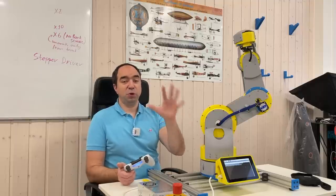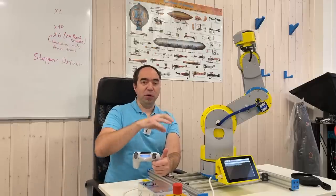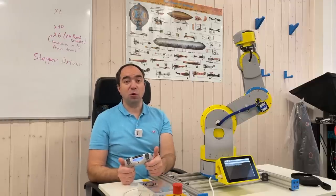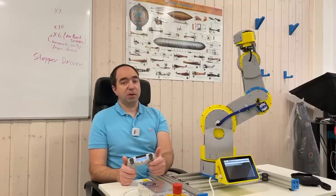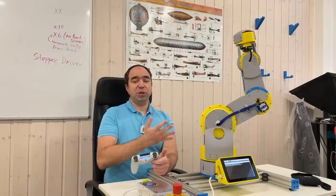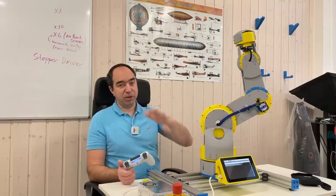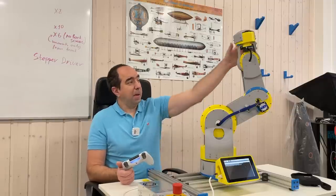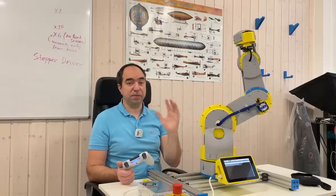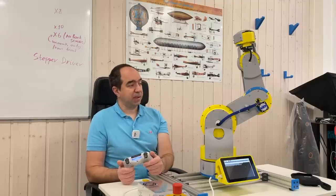There are some things which we need to improve. The program on the Raspberry Pi needs improvement — I'd like to implement the ability to save several points and play the robot between those points. I'd also like to have control of speed and acceleration through the Raspberry Pi and joystick, since right now we only control position. I also need to improve the calibration because 8 minutes is too much. Another big problem is that at some speeds you get vibrations, likely due to high backlash in the gearboxes and because the arm is made from plastic and isn't super stiff. We can try to reduce backlash by reprinting all the gearboxes with slightly bigger gears.